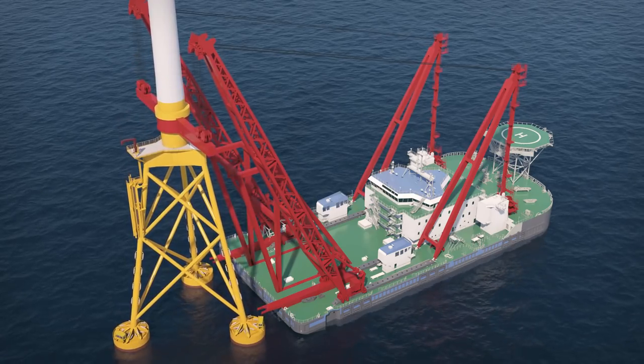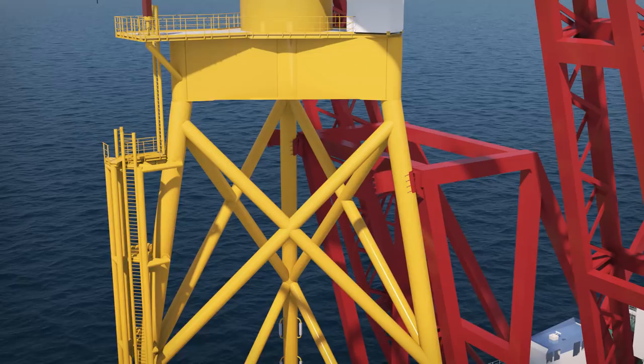Transport is done with an existing vessel like the Gulliver, designed for marine salvage, with a shear leg crane capable of lifting 4,000 metric tons. The vessel picks the complete turbine structure using the specially designed lifting ring built into the tower base, above the center of gravity, and lifts it directly off the SPMTs. The structure is then lowered partway into the water and securely attached to the vessel.